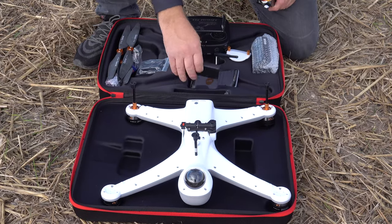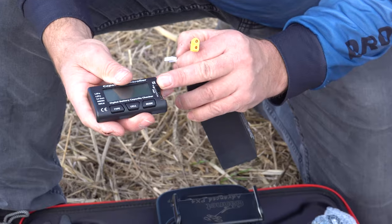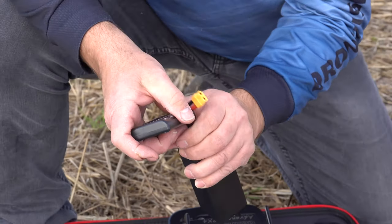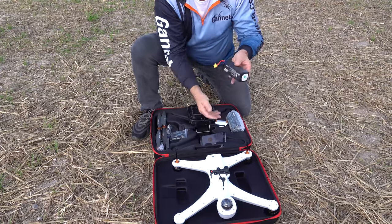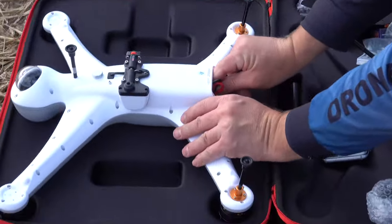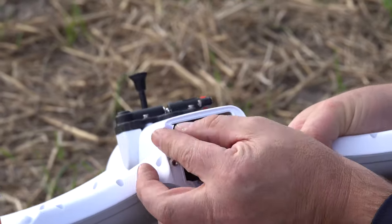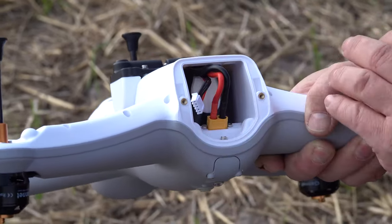I like to test my battery. Here's my battery checker — plug the connector all the way to the top so you can really see the voltage. I'm quite happy with this. Take the battery, plug it in nicely. Make certain the XT60 is nicely fitted and there are no loose wires on the balance plug, because if that is loose it will cause the battery to give you problems — most probably swell up or burn.